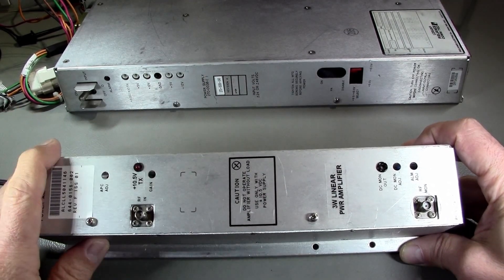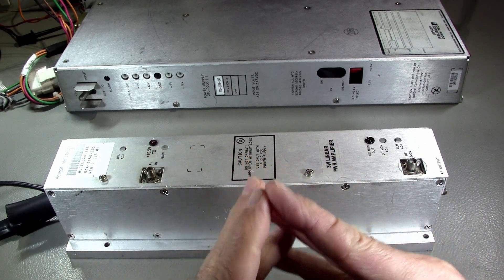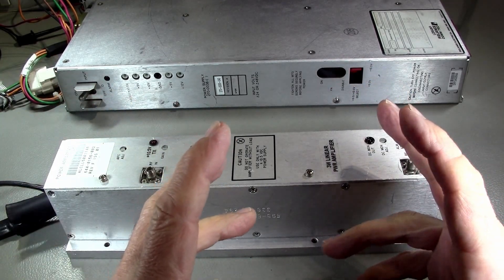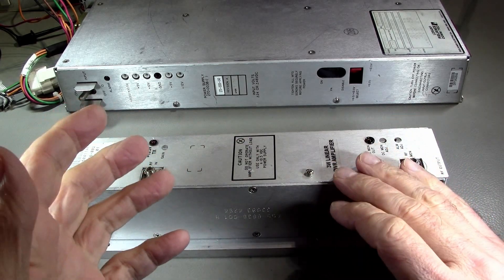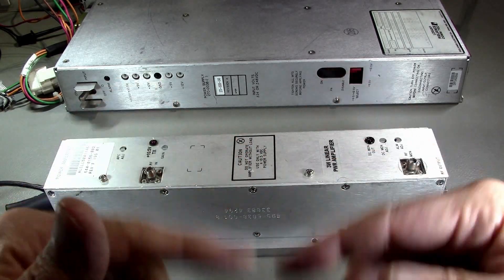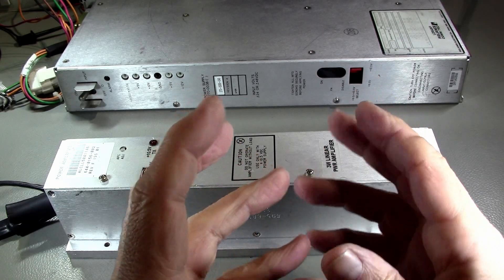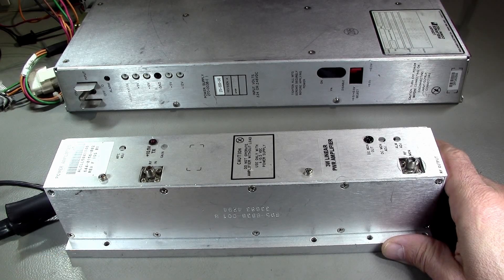On the next video, something completely non-related: it's going to be the IF transfer relay and attenuator combined into a single box. I created that little box that's going to be on the 144 megahertz side. In transmit mode, you need to attenuate the watts of power coming out of the two-meter transceiver down to milliwatts. So it's an attenuator with relays to switch, and in receive you need to remove the attenuator to get the full power out to the receiver. I'll detail this transfer switch slash attenuator in one of the next videos. Until then, 73.